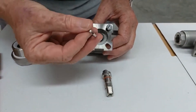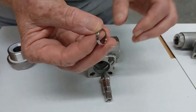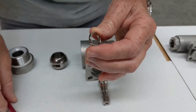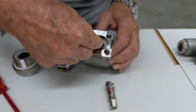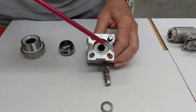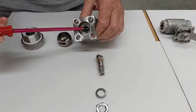There's a thrust washer which goes on the top. The thrust washer itself has a small groove on the side — you can see that groove. It's shaped so that it seals on the top of the top chevron and helps spread it out. So when it's pushing down, this thrust washer is pushing down on top of the chevron stack, and that then seals against the spindle.